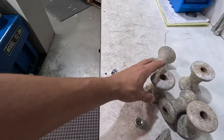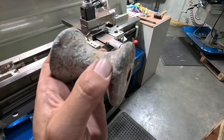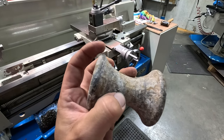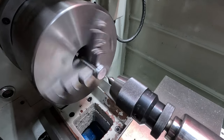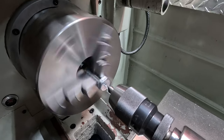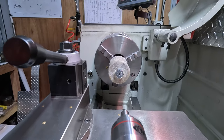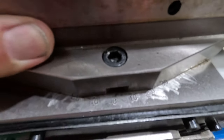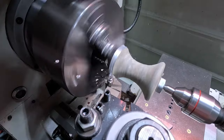Okay, I'm in at work now. I've taken all the rollers off and I'm just going to machine a little flat spot on each of these rollers so it can roll on the fiberglass and not destroy it with this edge. Got to make a bit of a jig first. Move the slide to 5 degrees so it suits the bottom of the boat.